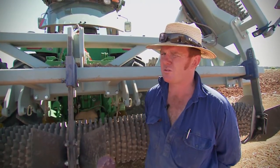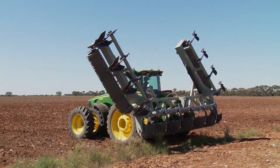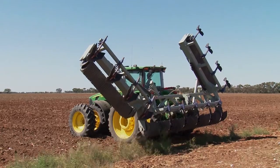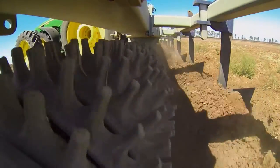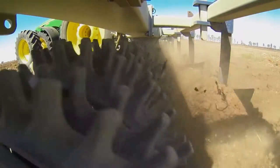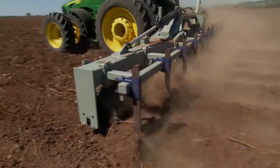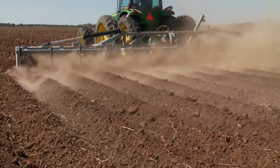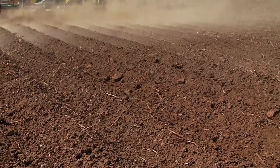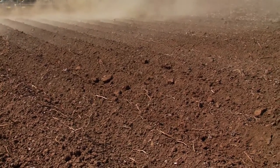Through the design process we also added a toolbar on the back — a 4x4 toolbar to hold shanks and high back hillers. That was principally to maintain the furrow after the loose ring roller's been through, consolidating all the hill, which helps us maintain our 12 row sets and helps maintain the furrow in between passes.